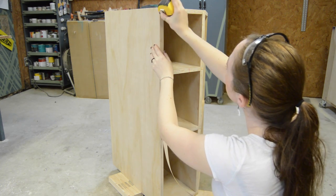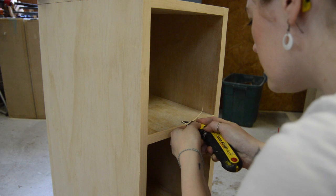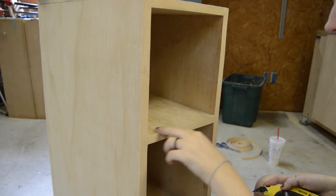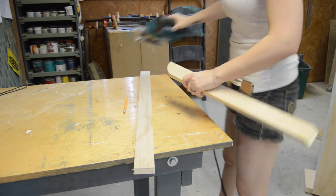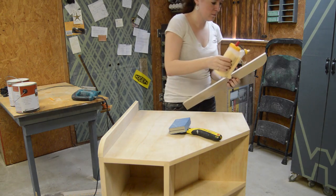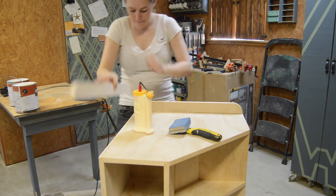Since I plan to stain the project, I picked up a few rolls of edge banding, ironed it on, and then cut off the excess. To hide the edges on top of the bookshelf, I cut two boards then used my jigsaw to cut a curve in one, used that to trace and make the second one identical, then glued and clamped these into place using paint cans.